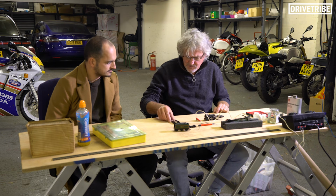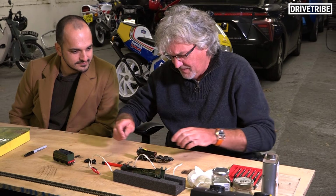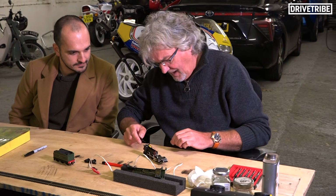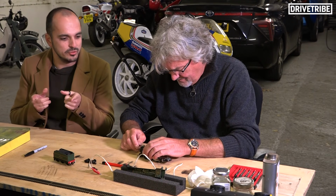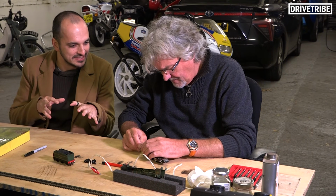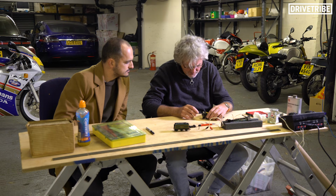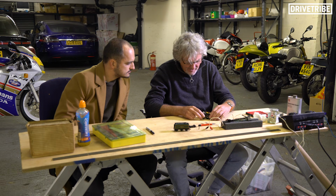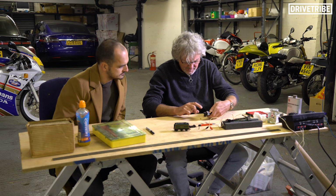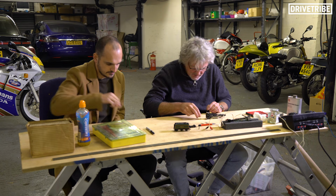So what I think we will do, Mike Fernie, if it's okay by you, is go back a few stages and take the rotor out of the motor again. Last time we did get it moving, but it kind of ground to a halt and obviously it wasn't clean enough inside. Yes, and we identified two problems. One is that the motor is still a little bit grubby, and the other, I've already taken the screw out of the motor, is that the chassis is also a bit tight. So if you could look after those for a moment.